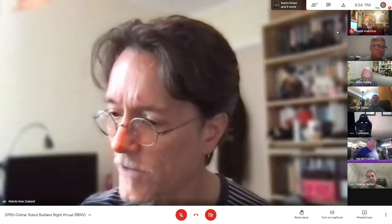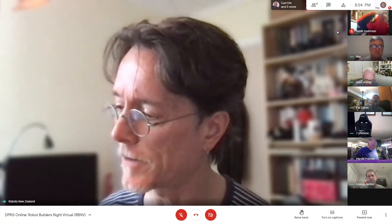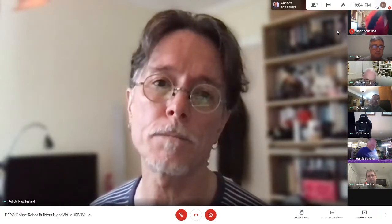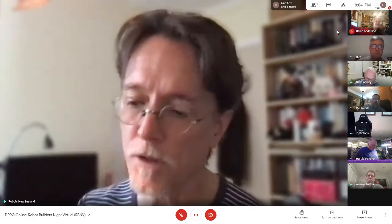I haven't actually needed it yet, because most of the devices I've been using have a little solder jumper on the back where I can change the address. But the one that I couldn't find that for was the optical flow sensor, and that one didn't have that. So if I wanted to have two of those, I was going to have to use that. That's why I bought this. But yeah, I'll put the link in. Yeah, that's basically the kind of device I'm talking about.